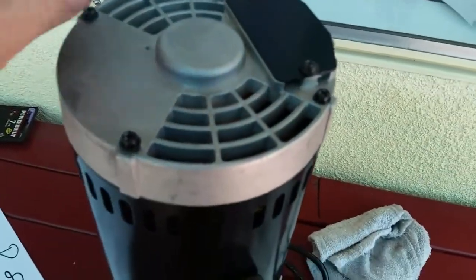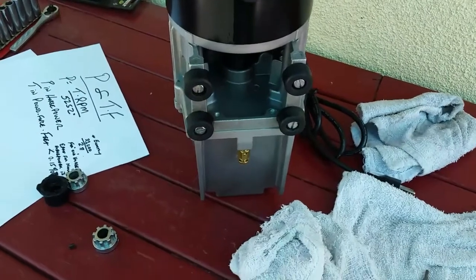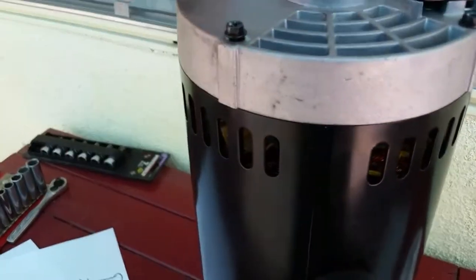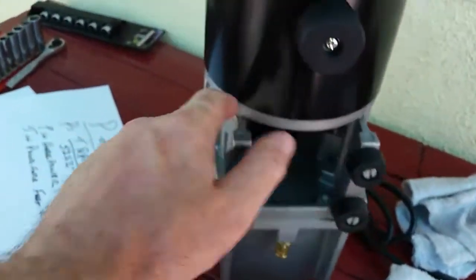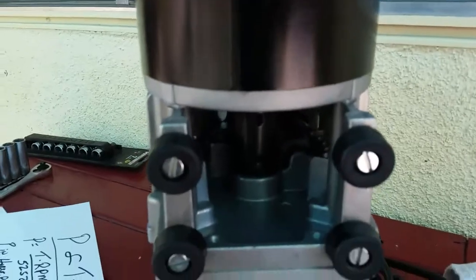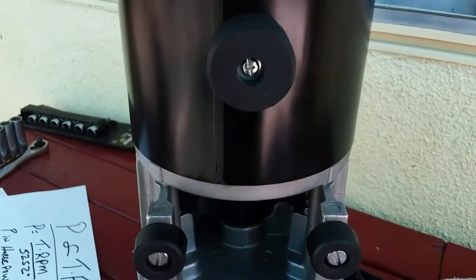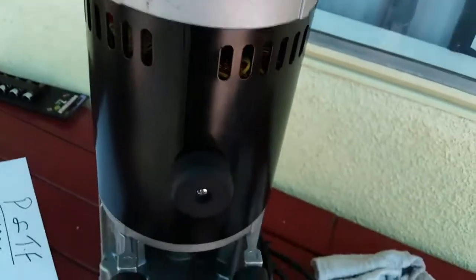Another intermediate step to ensure that the motor, this is a well-machined system, right? You can buy motor couplings that have flexible components to them to allow for some shaft misalignment. This doesn't need that. It's machined. It's a housing. The motor does have a bit of play associated with the fact that these 4 long bolts go through the motor and into the housing here, here, and the other 2 around the other side. There's some room for moving it around. So what I'm going to do is torque all 4 set screws there, and then tighten these where the motor wants to finally be exactly centered. That's where it'll be tightened. So that way it'll be a good alignment, no need for flexible coupling, and it'll just be ready to go.